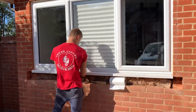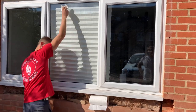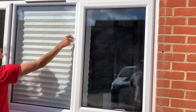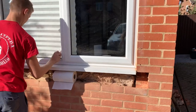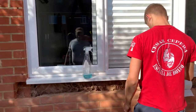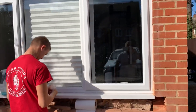So what we're doing now is giving the double glazing a good wipe down of all the dust — a proper builder's clean with the kitchen roll. Make sure we get everything clean, and then we'll give her a scrub up with a window cleaner and obviously wet the bricks down. This will help because when you're adding the white cement in the joint, you don't want any red dust going in — because when you joint it up, good luck trying to get it out. Do a good job.